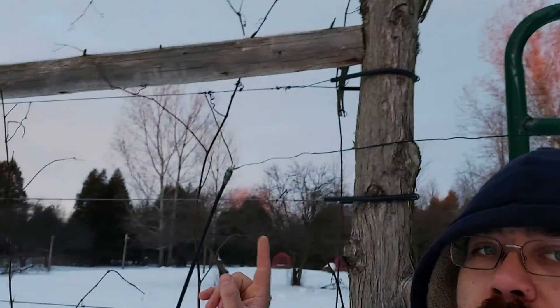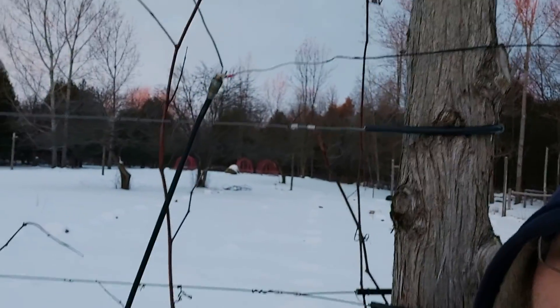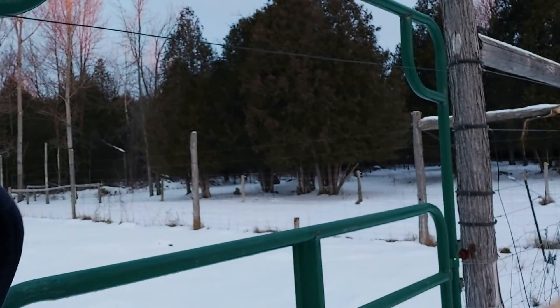The way I did the connection was very simple. I have the center conductor going to the wire on one side and just put a wire from the shielding across to the other side — and that was it. I'm going to do another video with an antenna analyzer to show the results, and maybe look at low noise amplifiers and improving that connection — maybe add a choke.